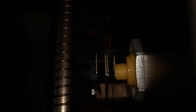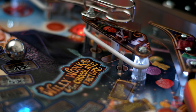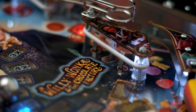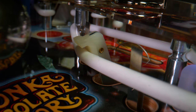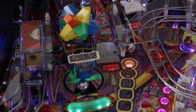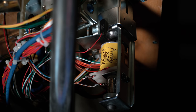You may be wondering why there are three leaf switches. You can actually press just the first one — that activates the lower flipper. When the first piece pushes the second piece of metal into the third, the entire circuit is complete and the upper flipper goes as well. Usually both go at the same time because you're really smashing those things. The slingshot, slightly above the lower flippers, has two leaf switches either side of the kicker, powered by a solenoid inside. When the ball approaches from either side, it completes the circuit causing the ball to be kicked out, often straight into the other slingshot. For the gobstopper hole, when a ball goes in, it's returned through a plastic channel underneath and shot back up using another vertical up kicker. When multiball starts, the auto-plunger — a piece of metal shaped to come out either side of the normal plunger — whacks the ball at full speed back up the shooter lane.